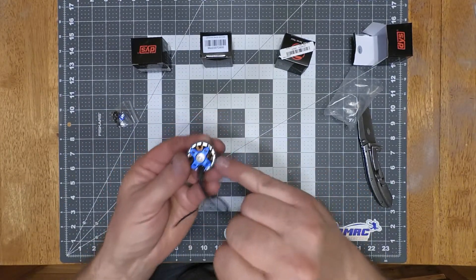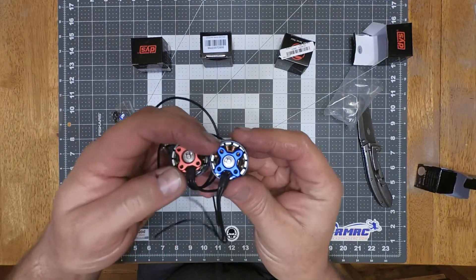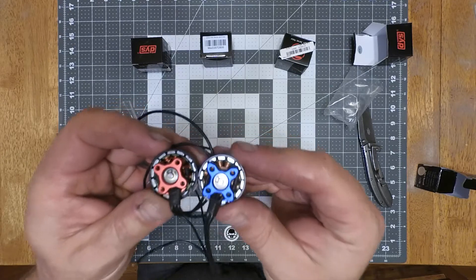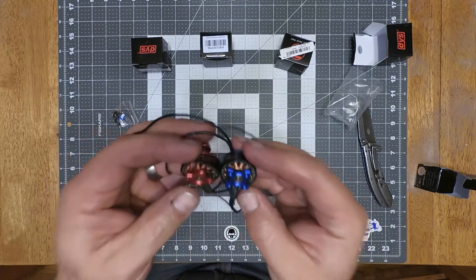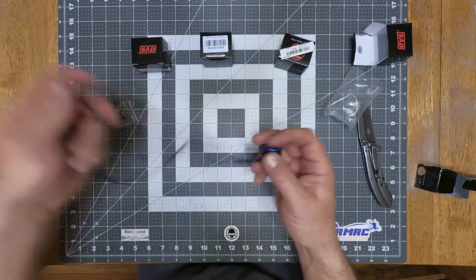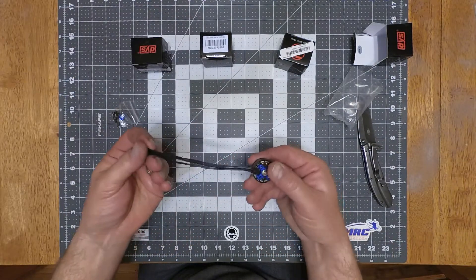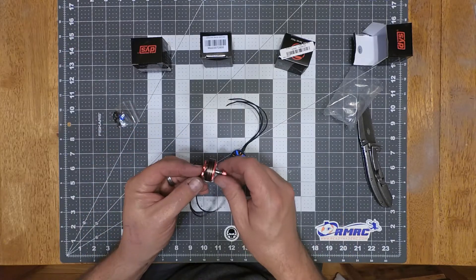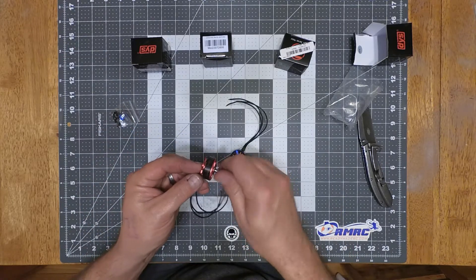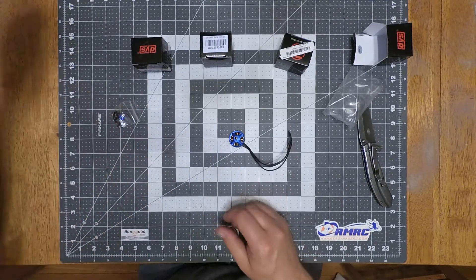These are a different shape — this one is like a star and this is rounded over. The windings are different. Got about the same air gap between the two. They have the nice long wires on them. The 2306 are definitely smoother, not as coggy and notchy. These are a lot more coggy and notchy than those ones are.